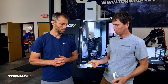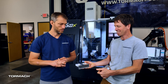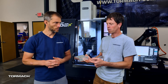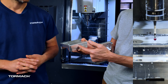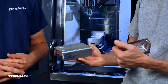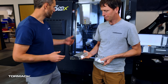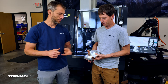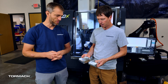When OP1 finishes we flip the work piece over, and that's what's presented to OP2 to probe. We actually have a fairly large ruby stylus on the probe — that ball is pretty big — and that allows us to get down below the top hat to probe the actual machined surfaces. Even with a self-centering pneumatic vise that repeats within a thou or so, we want better tolerance than that for this part, so we probe the existing part surfaces to bring the tolerances down.